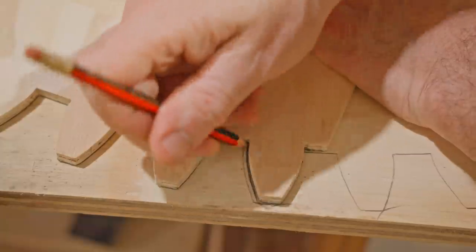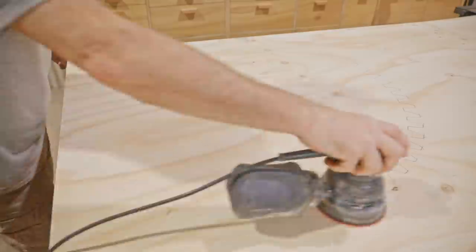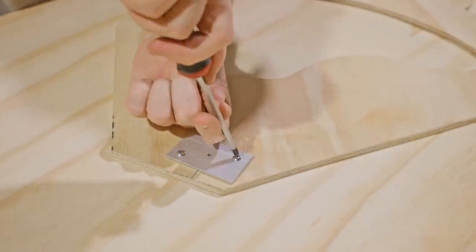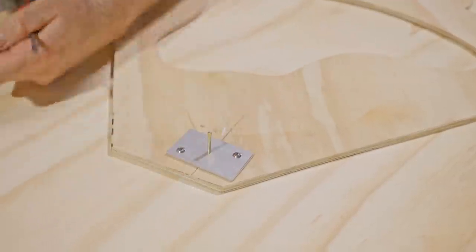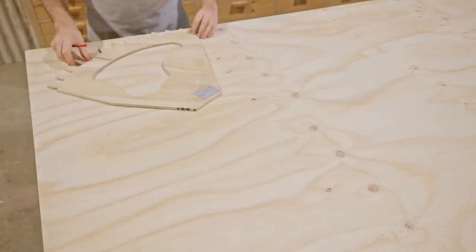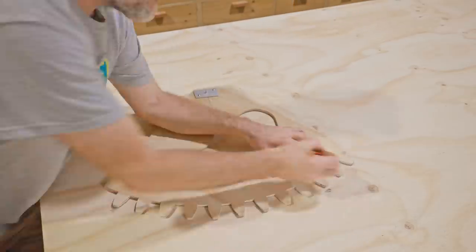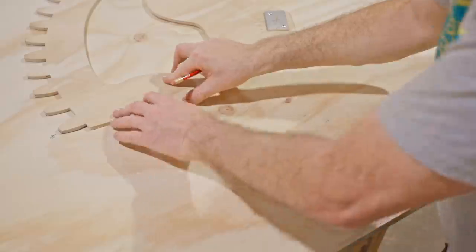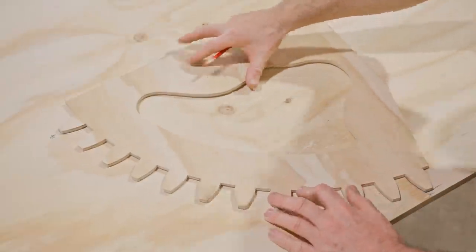You can see that it's slightly off, so I need to make an adjustment to the pin position. The circumference is slightly too small, so I need to move the pivot point further away to increase the diameter. I screwed a piece of aluminium to the template and drilled oversized holes for the fixing screws so I could move it around and make slight adjustments. I'm not so confident this time, so I marked just the first and last tooth each time I moved the template, and I ended up doing this three or four times making adjustments until it was just right.